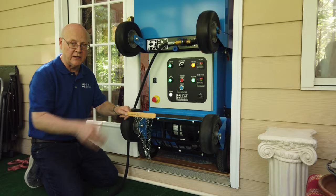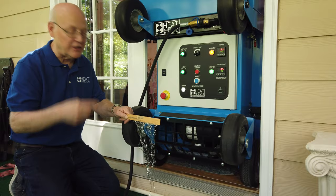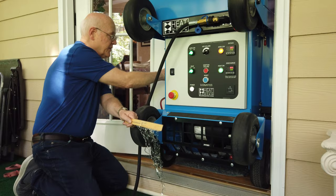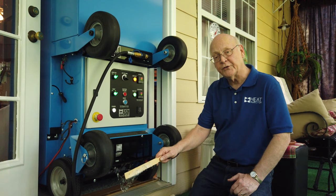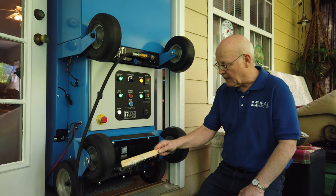What I'm showing here is some tinsel that indicates airflow. When we pressurize, you'll see an increased amount of airflow from the outside and less from the inside — this airflow starts to push through the cracks and crevices into the heated space. We'll open a door to pull additional airflow, then drop a damper. When we drop the damper, it pulls more air from the outside, and that airflow pushes heated air through cracks, crevices, electrical outlets, phone connections, and any kind of opening in the space.